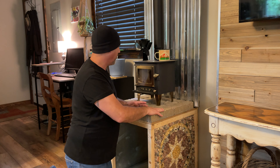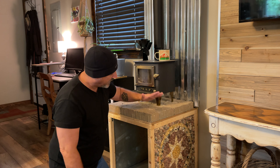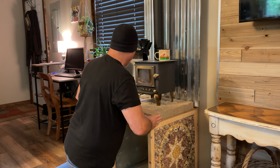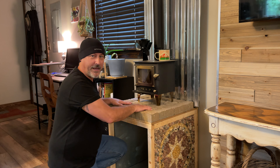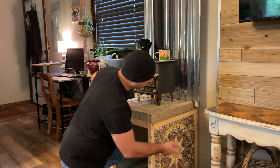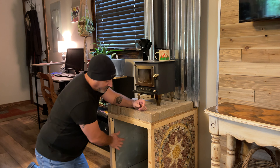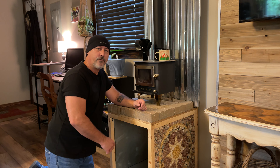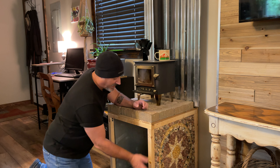The height of the base for the wood stove is designed so I can see the fire through the window from across the room sitting on the couch. These are patio paving stones — not even fire bricks — that I bought and put together before I designed the base. I needed to know how big my pad was going to be, then built the box underneath. I'm still not finished — there's some bare wood showing. I'm going to add more decorative trim to hide that. The box down here stores enough wood for about three days of heat.